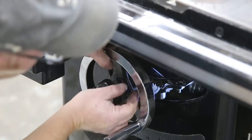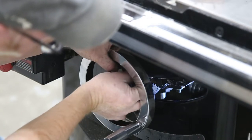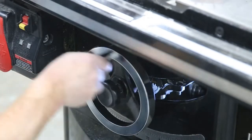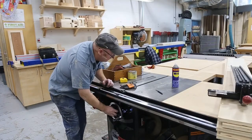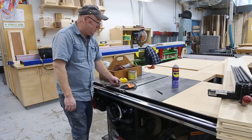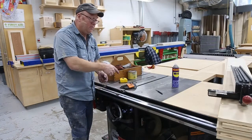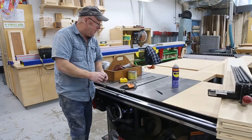Three millimeter Allen wrench for the handle. Our blade lock's into position now — success story! So all it is is just a simple little keyway. It's only a 20-minute fix, but it's one of those things that's just a pain to get at. Once you get started, it's not too bad. The only little tip I can give you is if you're going to have to do this, make sure you vacuum the inside of your cabinet out because you will probably drop one of those washers — you don't want to have to be looking for it. Pretty simple little fix.